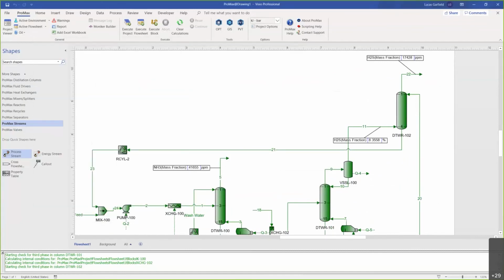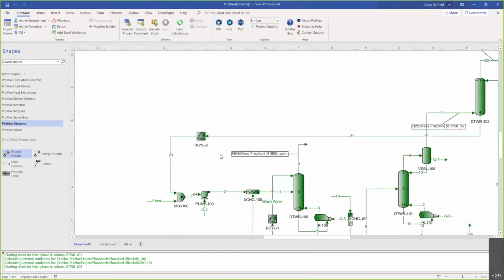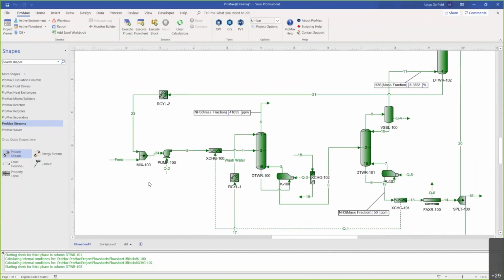First question I had from Jelle: is the feed normally not always equimolar in H2S and NH3? Not necessarily. Sometimes it is equimolar, sometimes it's not. It really depends on what units it's coming from. There's a question, what thermal model should we use for the sour water stripper? Again, we're using the electrolytic ELR package for that.